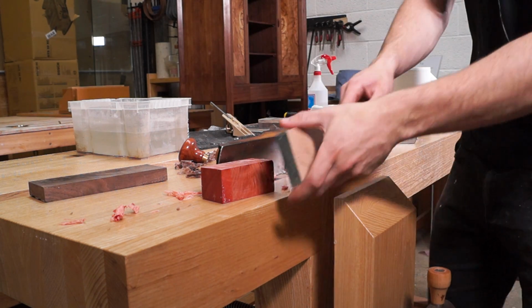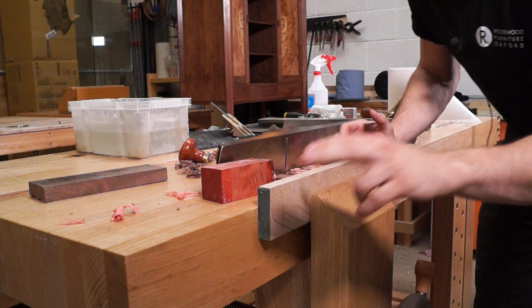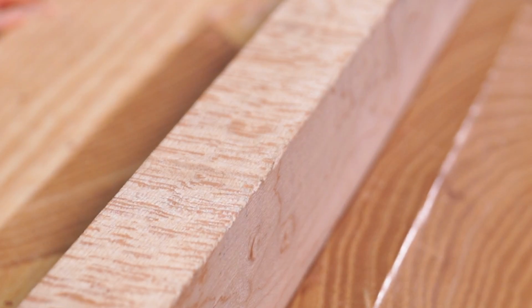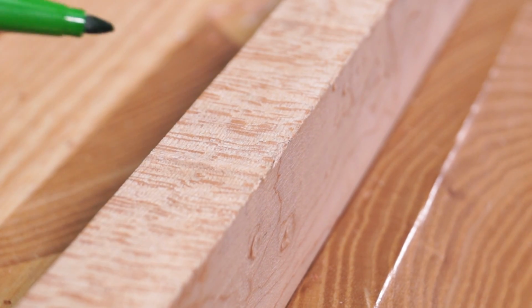We're gonna try it on this edge here with all the sort of flecking on it. So let's get a close up on that and see what sort of tear out we got. Well, obviously there's so much going on with the grain on this, it's difficult for you to see the tear out, but if you focus on the edge here, you can see that it looks a little bit choppy. So I'll just adjust the focus. There you go, so you see that edge looks a little bit wiry, doesn't look too crisp. That is the tear out that is creating that.